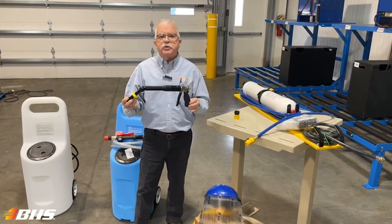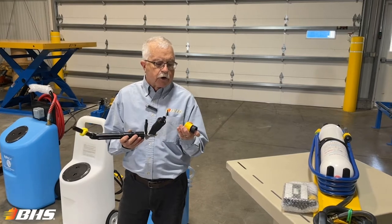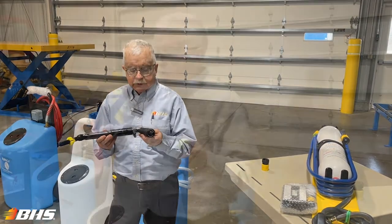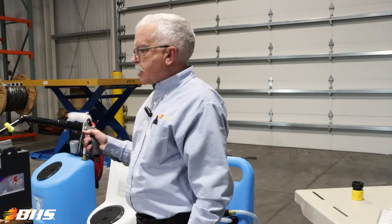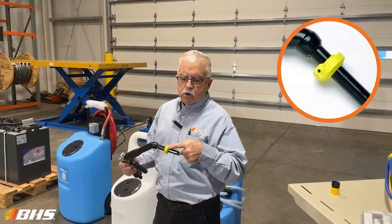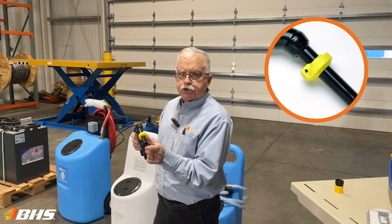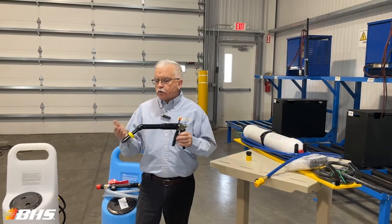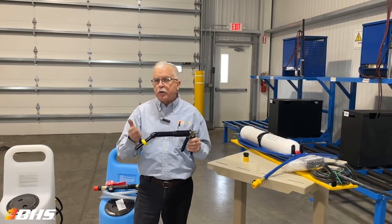BHS offers the WGX unit. It's constructed of heavy-duty ABS plastic and equipped with a quick disconnect for attaching to a standard garden hose or the water carts, which we'll get into in a minute. Notice that the handle is tapered back as well as the nozzle — this is a good ergonomic fit, eliminating a lot of the bending and reaching. There's also a yellow collar which is adjustable via a simple Allen wrench, allowing you to achieve the proper height for your battery type. And of course it has the auto shutoff feature — when the proper level is achieved in each battery cell, the unit shuts off automatically, much like a gas pump with your automobile.